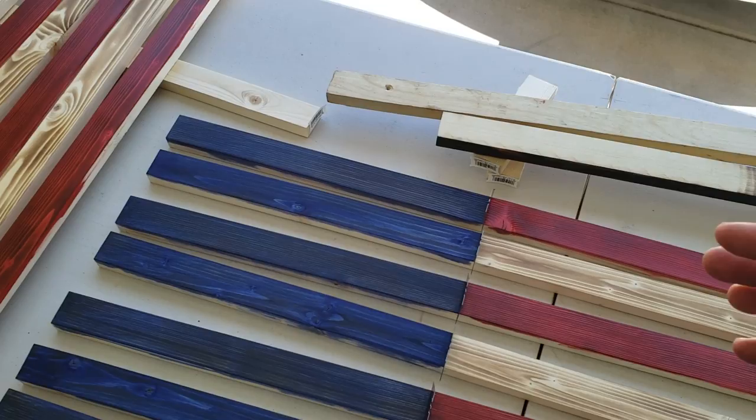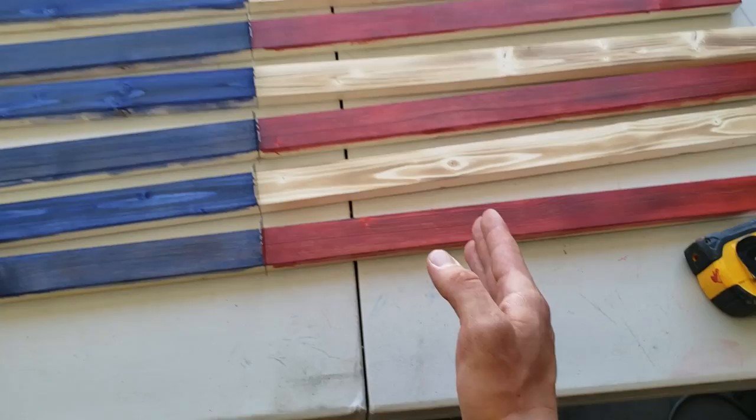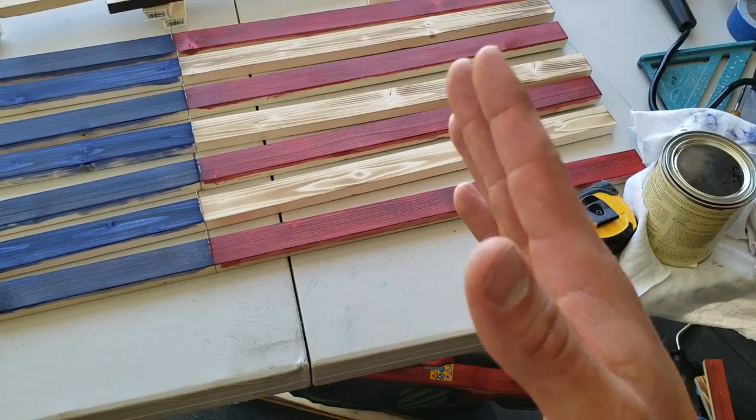So we'll do 1.5 inches on the back. You'll do 1.5 inches in, make a line, and then you'll do 14 inches in and make a line. Then you go from this side, 1.5 inches and 14 inches. Your strips on the back will go on the insides of those. So it'll be 1.5 inches and then you'll have a strip. You'll make a mark on the top one and on the bottom one. So then when you go ahead and glue it, you're not trying to make sure that they're marked out right. Then you got lines, so you can just line them up and nail them.